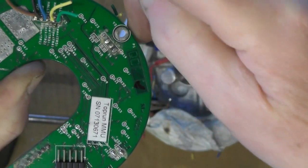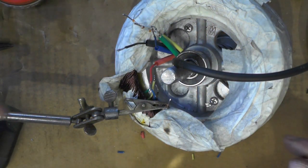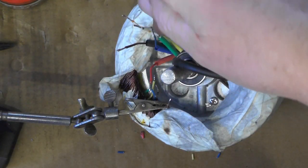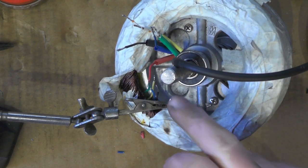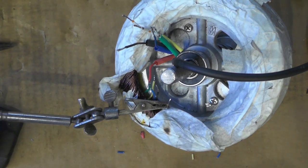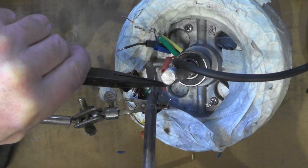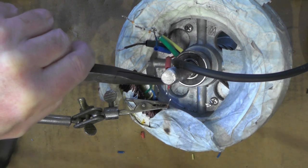Then you've got your signal wires: blue, yellow and green. I've cleaned them with some brake cleaner just to degrease all the wires. I've tinned all the ends of the wires to prepare them, I've put some regular flux on, and I'm now ready for attempting to solder these wires on. I've also put some shrink tubing over the wires just to insulate them when I've finished.